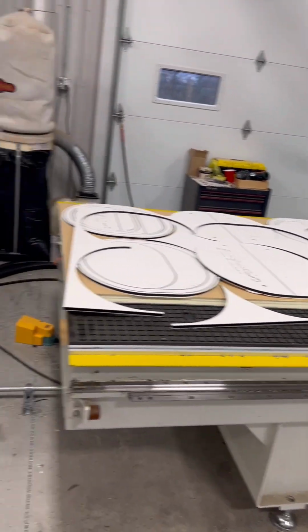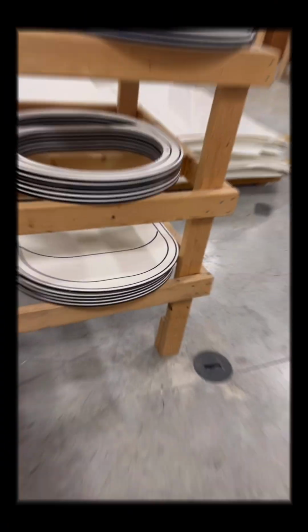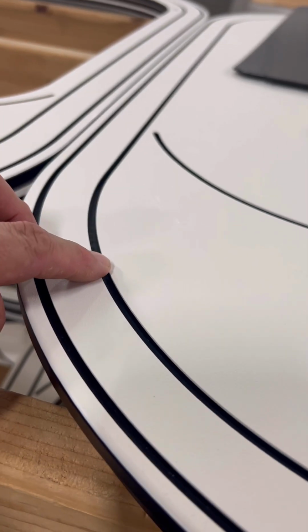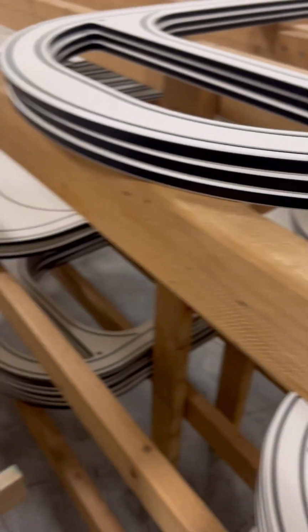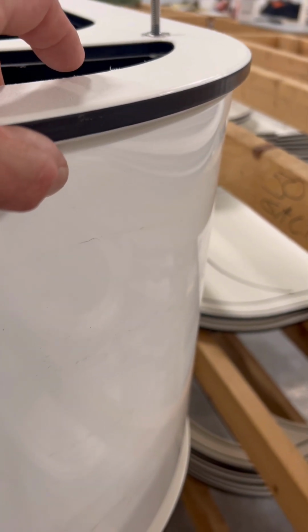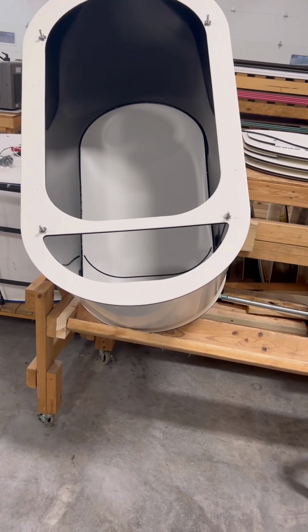Once those are broken out, we bring them over here to the shelf. This is where we get ready to route. And then we start our welding process. The first thing we do is we weld the inside wall, and then we water test it. Then we put the outside wall before we cap it. So what you see here is a 1-inch air pocket, which is literally between these walls. That serves as your insulator. Since heat prefers a solid surface to transfer through, the air pocket breaks up that transfer of heat, and that's why these tanks are able to stay as cool as they do.